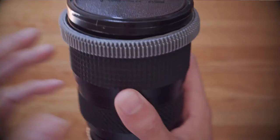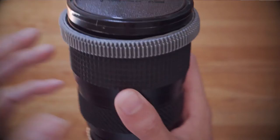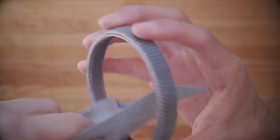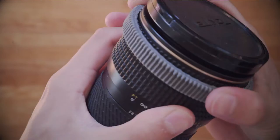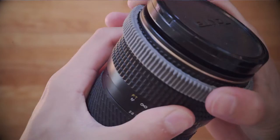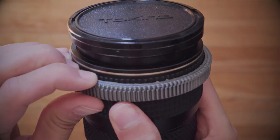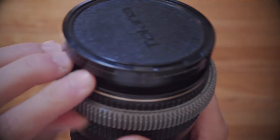After printing is done, get rid of any imperfections by sanding them away. I always used a coarse 80 grit sandpaper, but you can use a finer one if you want a finer feel. Usually the gear doesn't fit the lens right off the bat, so it's a repetitive process of trying to fit, sanding some of it away, and trying to fit again. Wiggling and patience are your best tools. You will have sore hands after doing this for a while. Lenses that have a rubber ring for focus fit better than lenses with a full metal construction, because the rubber helps with grip for the focus gear.